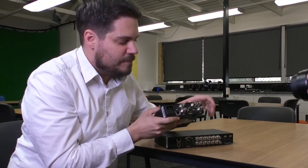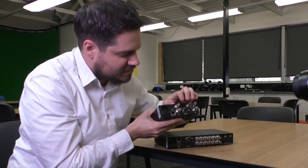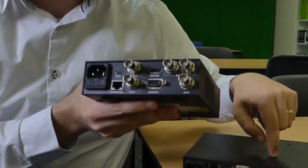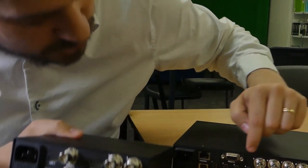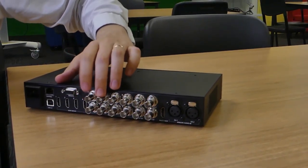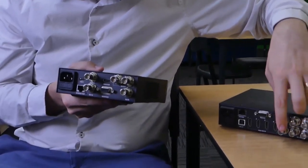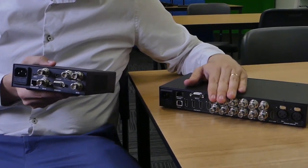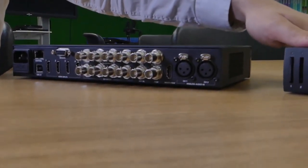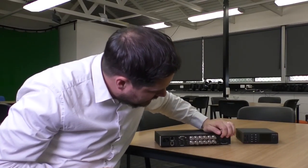The Hyperdeck Mini has an HDMI out, but to use it as a recording device you actually need to use one of the SDI ports on its side, because that is how it directly connects to the TV Studio via the SDI outputs at the top. The best way to hook up the SDI from the TV Studio into the Hyperdeck is using one of the first two SDI output ports. So you can put extra devices like the Hyperdeck via SDI, and also cameras.